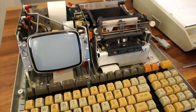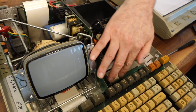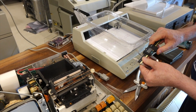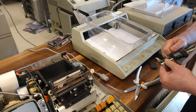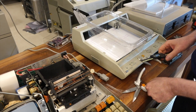We're just going to disconnect the tape. The right way to do it is with a shim to protect the cable as we pull it out — let's do it the right way. We're going to do a very scientific cable pull. If you just pull them carelessly, that damages the cable — they're extremely fragile, and once those are gone, they're extremely hard to repair.